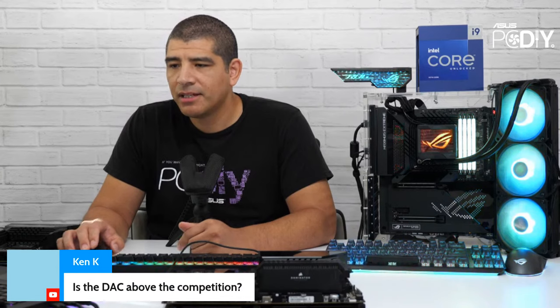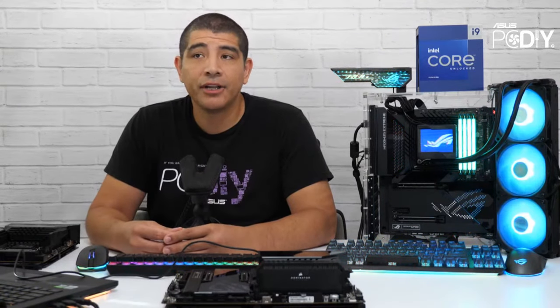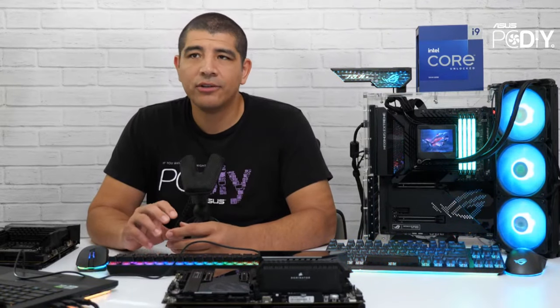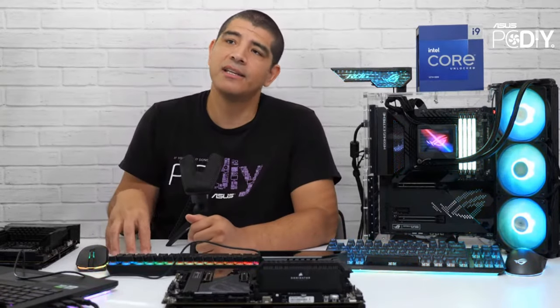Ken K was asking, is the DAC above the competition? Most boards, you won't actually find an ESS Saber DAC present on the motherboard. You're going to probably find just the standard audio codec. So you'd kind of have to compare that. There are also differences in layout and in how you do some of the filtering, whether you maybe have a pre-input power regulator. There's a lot of things. So when you talk about audio design, you can't just measure component to component. You have to really talk about the totality of the design implementation.